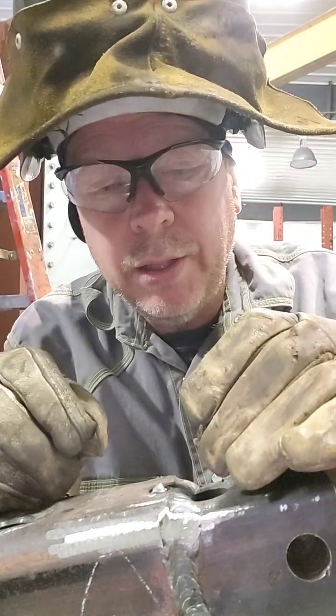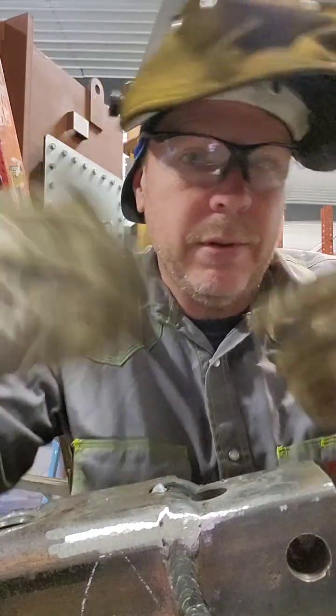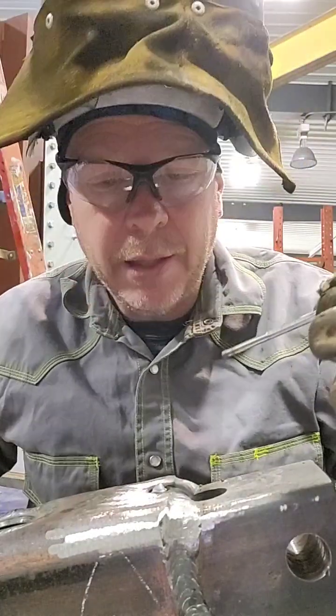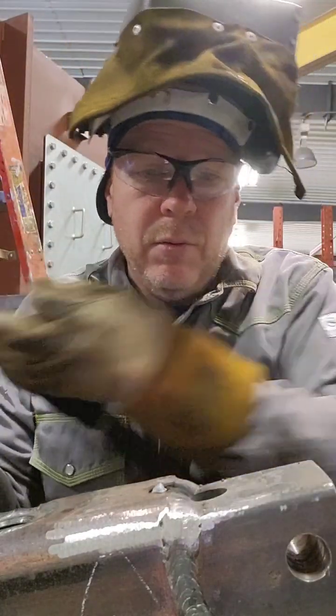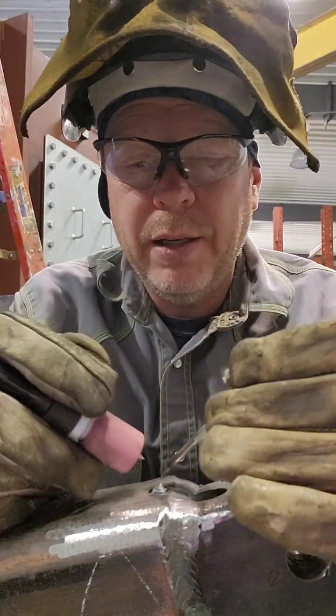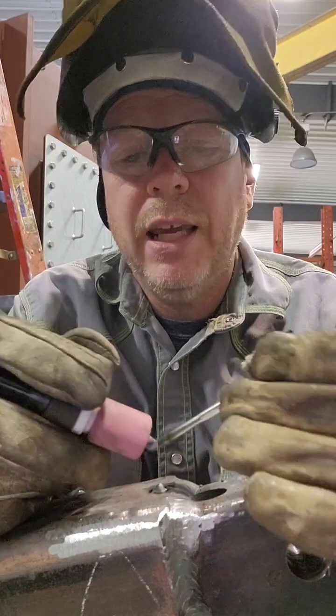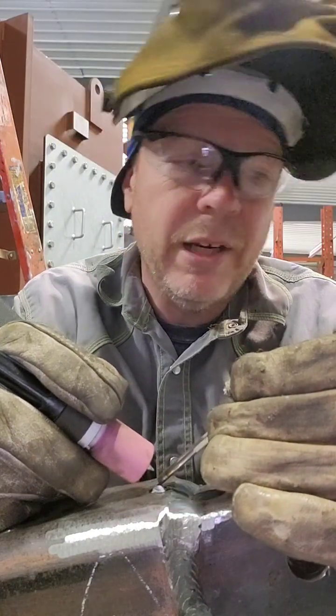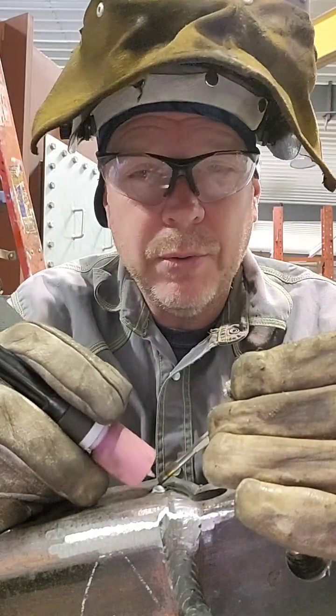After you've welded on it, you could actually add a little lube to it — it'll kind of help release it. I didn't find any square stock nearby, so I'm just going to use this piece of stainless 308 welding rod. This is 5/32 — it's pretty thick, so I'll heat both of these up together so they're both hot and I'll blend them together. That way they'll bond well. I'm going to add a little bit more metal to it to give it some rigidity.